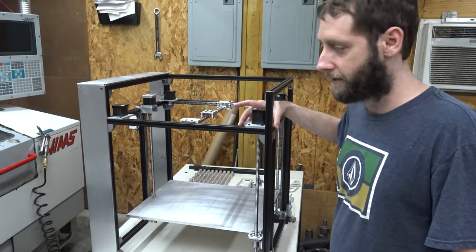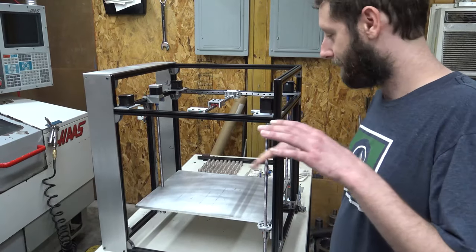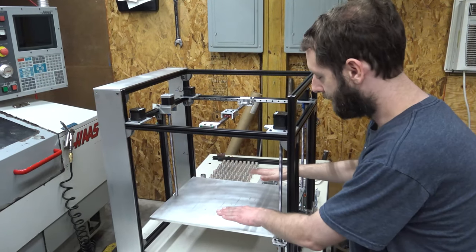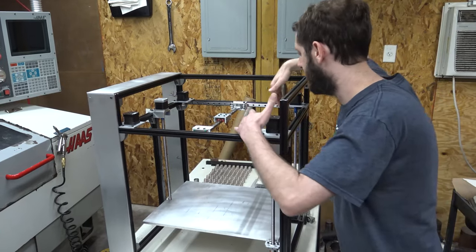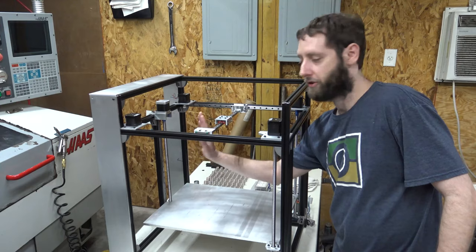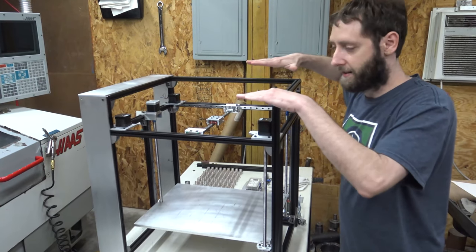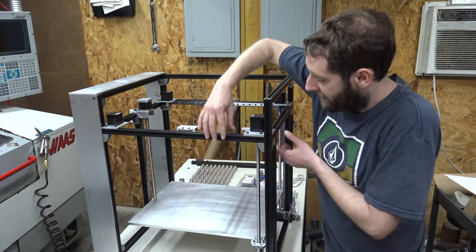As the motors move the bed up and down, you're adding the possibility of deflection. We don't really know until we get there — we'll measure for deflection. This is quarter-inch-thick aluminum so I think we're good, but just as good design practice we want to minimize any possibilities of something going wrong. Having the motors on top basically adds the possibility of deflection as the bed moves up, since all your accuracy on X and Y is based off these plates and this carriage. If there's any issue with the ball screw not returning concentric with the motor, you'll get some kind of wobble effect that transfers to the plates.